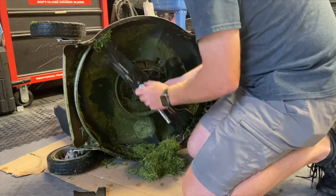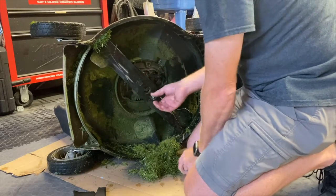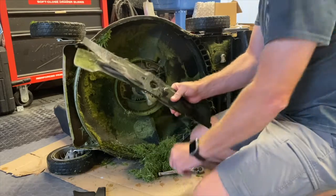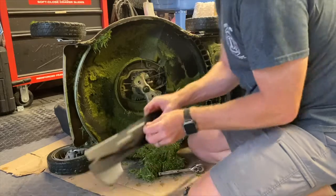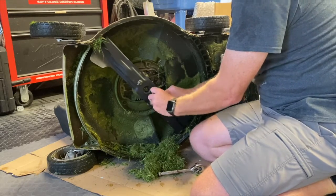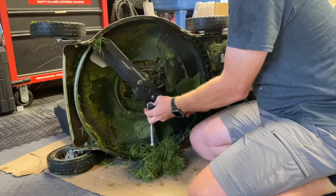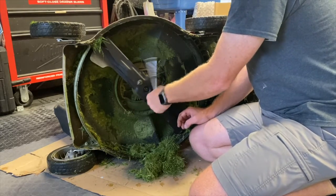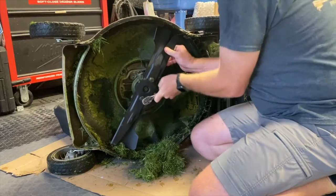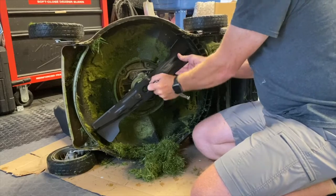I often hose down my deck. I pull the old blades out and, keeping them in the same exact format, just put the new ones back — it's that simple to change out blades, just two bolts. The best part is your cut performance with new blades will be great. With worn blades you end up chewing up your lawn, leaving jagged edges, and the tops of the grass will brown out because it's not a clean cut — similar to when you cut a bush back poorly. That's why we put new blades on every once in a while. You could sharpen them on a bench grinder, but I prefer replacing them.